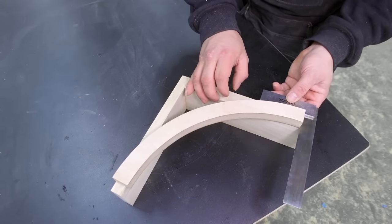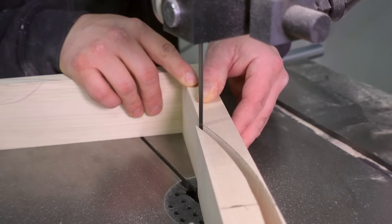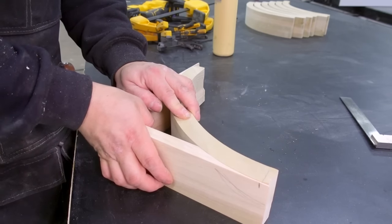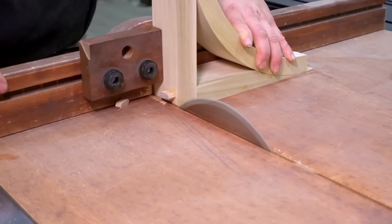The arcs will join these L brackets, so I'm using the template to mark where I should cut. I'm about to cut the protruding domino off of each piece so I can sand each buttress perfectly square with the edge sander. In theory though, if yours are already as square as you want them, you can leave the domino or dowel because it will serve as an alignment pin later.